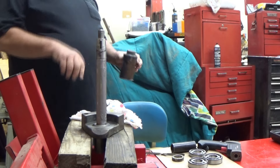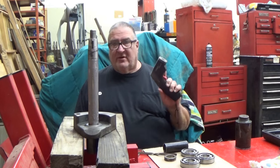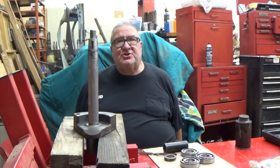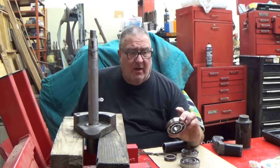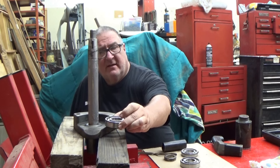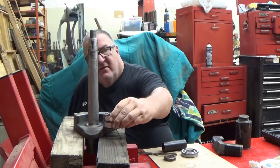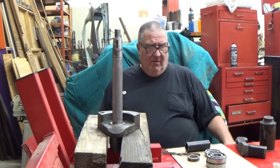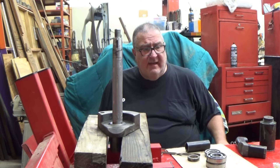Now, because this is an experiment we should know what we're doing as far as temperatures. We have our temperature gun and we just checked the oil — it's 163 degrees. The first two bearings we're going to put on are these bearings. It goes double on this 25-45 crank — double bearing down near the journal, which is between the blocks for the connecting rods. I did clean out the saucepan very clean so there's no debris that can get inside the bearings.